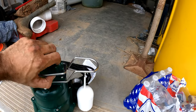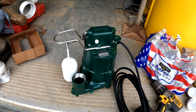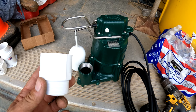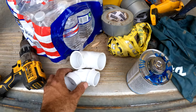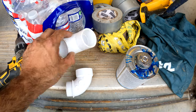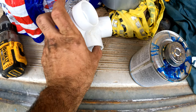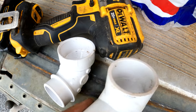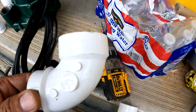The pump we're going to install is a Zoller M98 — a really nice pump that will pump solids too, so any debris that gets in there it'll pump right out. We always use pressure PVC pipe and pressure PVC fittings for pump installations. I have here a non-pressure inch-and-a-half 90 and a pressure inch-and-a-half 90 — take a look at the gluing surface difference. You can see just how much more gluing surface the pressure fitting has. So don't use non-pressure fittings for pressure applications.